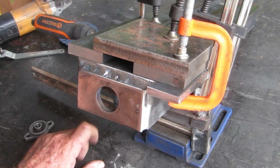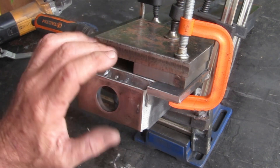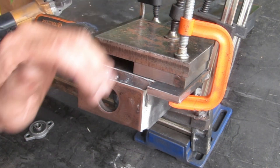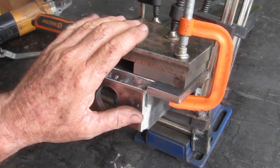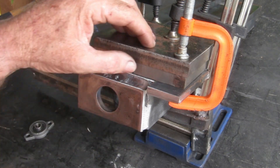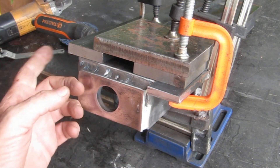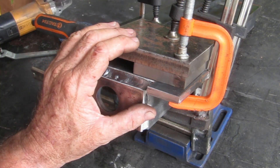So this is the way I'm going to set it up. Rather than having dovetails — I was originally going to try and cut a dovetail in this piece so that the outer piece was mated to this and ran up and down it — I just don't think it's strong enough for what I really want to do. This will be the top plate. It'll have a 15 or 20mm plate on top depending on what I've got. These two bars will be bolted to that, this little bit of half-inch square will be bolted through the top here, and the opposite side will have a brass gib in it with adjusting screws.